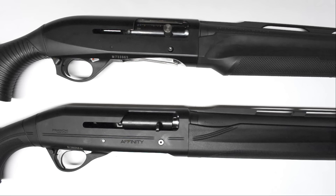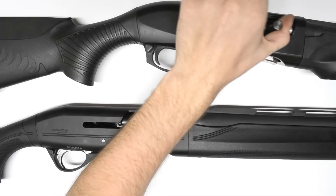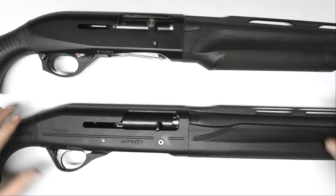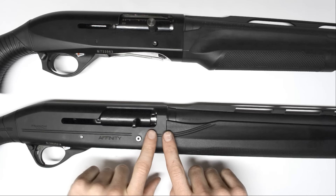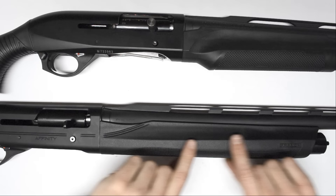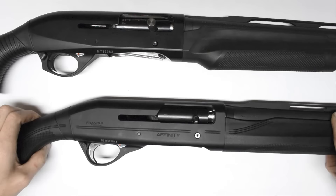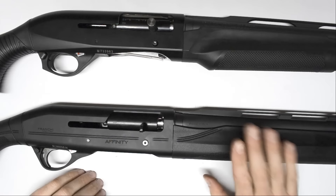The difference between the Benelli M2 and the Stoeger is that on a Stoeger, instead of having the recoil spring inside the buttstock, there's a tail on the end of the bolt, and as you pull the bolt to the rear it pushes a spring that drops at an angle into the stock through a tube back there. On the Affinity, there are rails like you'd have on a pump shotgun, with a spring inside the handguard as your action spring. It's still recoil operated with the Benelli inertia system — the bolt goes forward just like the M2 — but the action spring is up here under the handguard instead of in the stock.